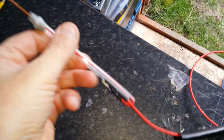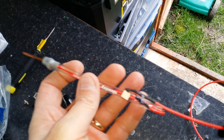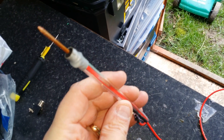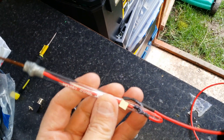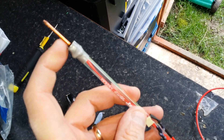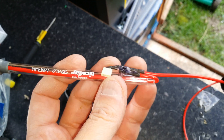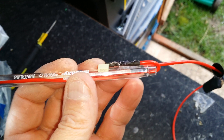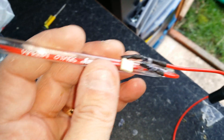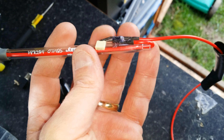This is a very basic test probe to track an AC signal on a circuit. I've got a mixer with a broken track, so I'm going to use this one — it's a pen with a copper nail and a little capacitor. All that does is block DC, because capacitors will pass AC, which is what an audio signal is.